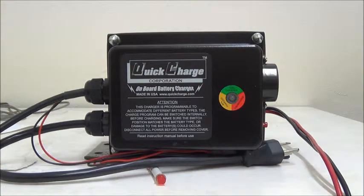To simulate a floor scrubber, golf car, scissor lift, pallet truck, or other battery-powered equipment, I'll decrease the voltage across the leads to the point where the alarm is first heard. For our 48-volt charger, that would be around 42 volts, and is the point where the operator should stop and recharge the batteries.